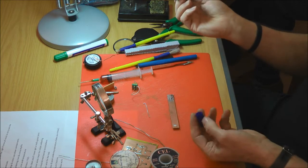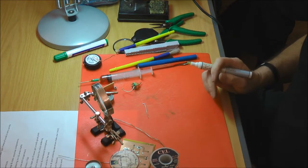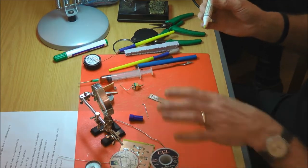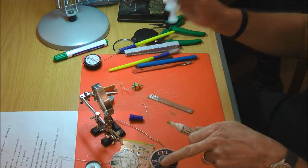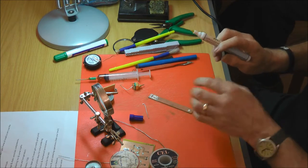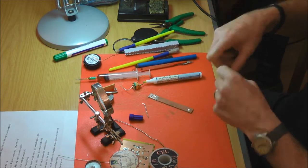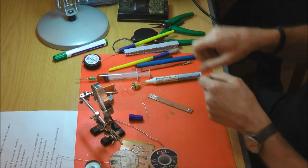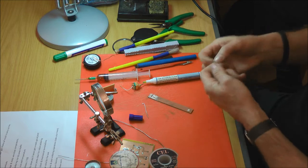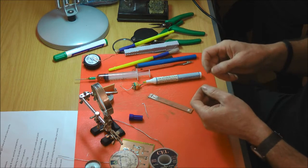This, as I say, there's no colour to it. That'll be an acid, will it? No, it's not. These ones are non-acid fluxes, and the rosin in the solder is non-corrosive. Some of the early fluxes, I don't know if anyone remembers Fluxite. Yeah. When I was a little lad, it used to be the copper soldering iron in the stove. Heat it up, tin it. I've got loads of it. But it's pretty corrosive stuff, so when you solder with it, you've got to clean all of it off. If you're doing electronics, the last thing you want is anything corrosive going anywhere.